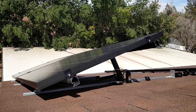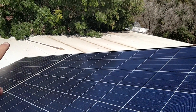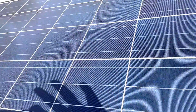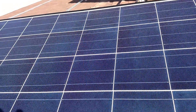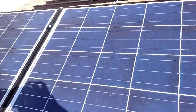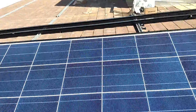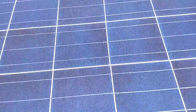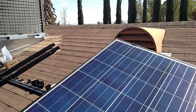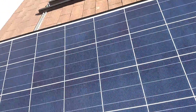I'm setting these up in landscape mode. These panels are going in landscape mode — portrait would be when they'd be standing up, flipped 90 degrees. At this point, if I were to stand these up in portrait mode, I would have a very long leg at the end and they would be standing up really high. I didn't want to do that. I wanted to keep them as low to the roof as possible, so that's why I did it this way.